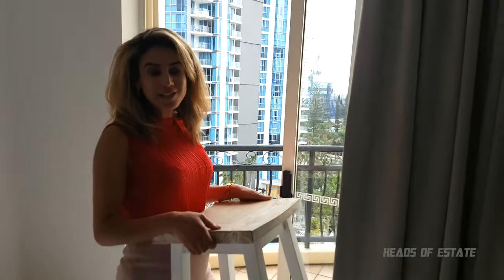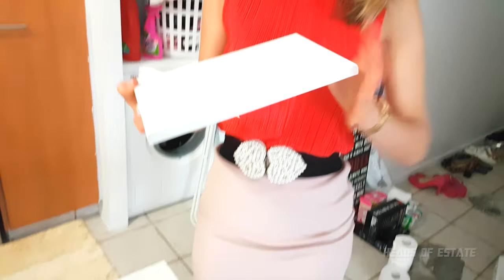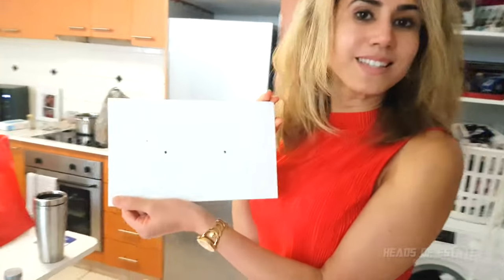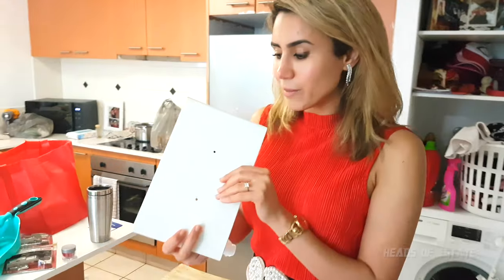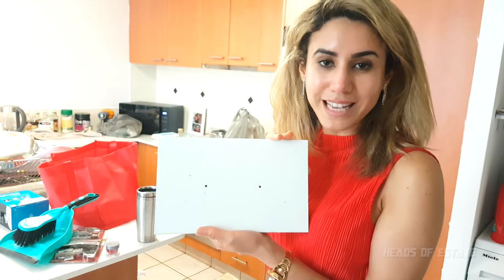It's just been raining outside, so I've brought my pieces in — they're a bit wet but I'm going to dry them ready for the next penultimate coat of paint. I'm going to do it when the sun comes back out. Here are the drawers after two coats of primer — as you can see, that nasty yucky original color has now gone. Once it stops raining, I'll sand it down a little, put the first coat of gloss on, leave it overnight, then apply the second coat.